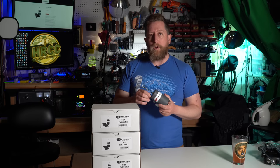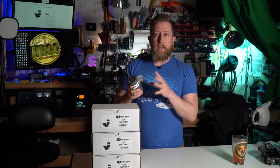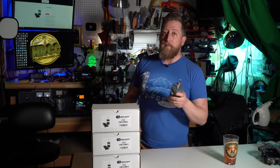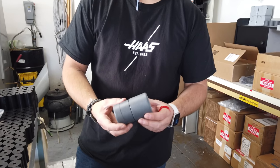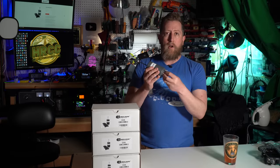I've found that the tuner on the ICOM 7300 is about all you need — you need about a three to one tuner. This isn't a nine to one un-un type situation where you need a nine to one tuner or better to bring the SWR down to get the match you need. If you remember from the factory tour I did at Chameleon Antennas, this is actually sealed waterproof — one entire unit that can sit out in the rain with no problem, so long as you do a good coaxial connection.